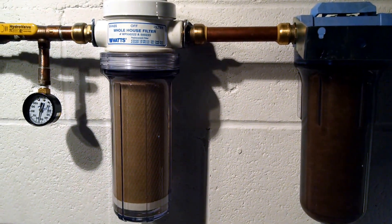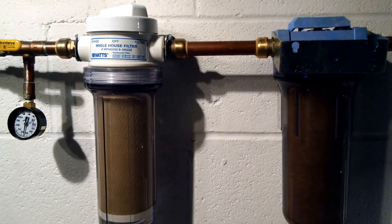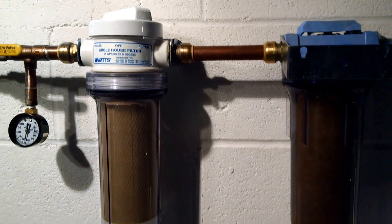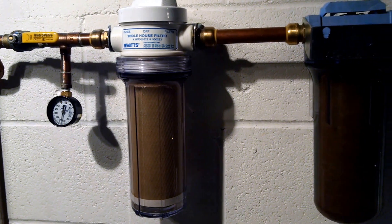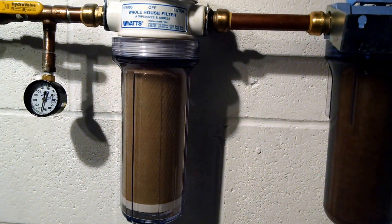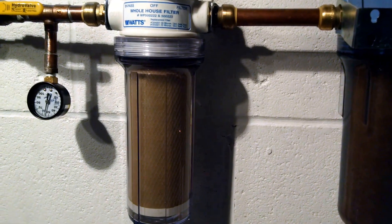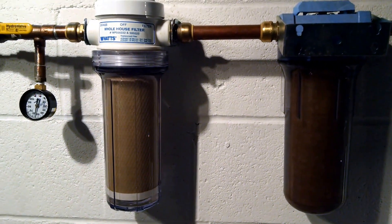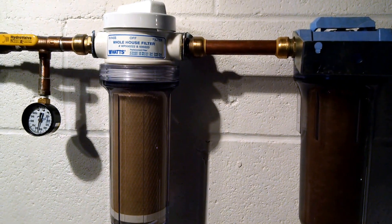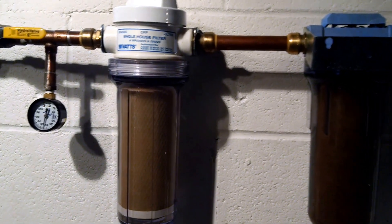After that there's a carbon block filter. The reason for that is because this is surface water — it's shallow water, directly recharged by surface runoff. Rainwater, road salt is in there; you can have pesticides, contamination from neighboring septic drain fields. A carbon filter is probably not a bad idea and allows you to filter out pesticides, herbicides, smells, tastes, and things like that. I don't really smell or taste anything in this water, but considering how close to the road I am, this seemed like a good idea.